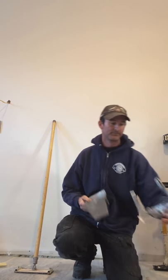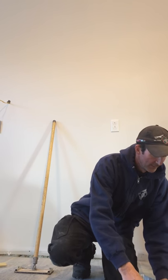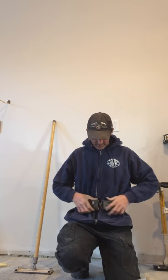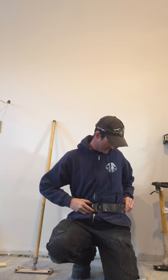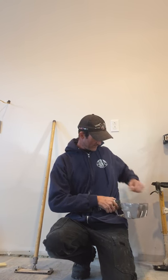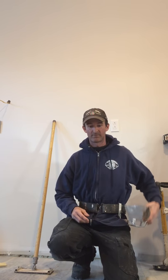Next we have the pan holder. This is a lifesaver. I use this to free up my hands when I'm applying the tape, because after you put the mud on the wall, you need both hands to put the tape on. I have my belt — I purchased this at the Army Surplus — it stays right where you put it as far as the adjustment. You take the pan holder, stick it right on the belt, and now you can apply the mud, put it off to the side, and it stays out of the way and allows you to keep working.